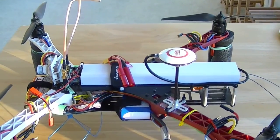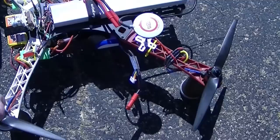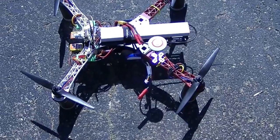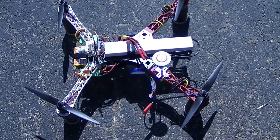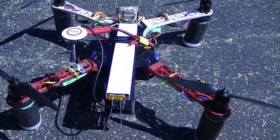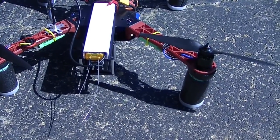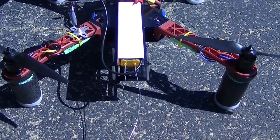We don't have any clouds today and that may make a difference for the GPS as well, but the biggest difference is the 400 milliwatt transmitter instead of the 800 milliwatt. I don't have the Mobius on here right now. Right now I just have the quadcopter flight battery plugged in, the transmitter battery is not plugged in, and I'm just trying to acquire some satellites. It only took about 45 seconds and I've already got all the satellites - I've got a blinking green light.